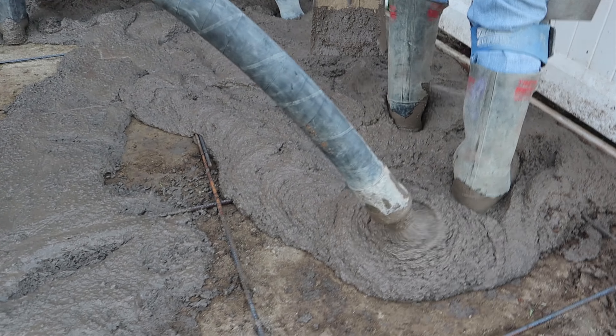That's a three-quarter deep, half-inch radius joint. I typically don't do a lot of hand joining because they never really turn out that straight and they have a tendency to hold a lot of water. Water sitting in joints causes stains — mineral deposits are usually a light color, so if you have dark concrete you end up with an eyesore in a few years. Saw cuts retain less water and cause less staining.